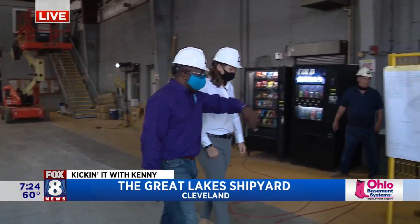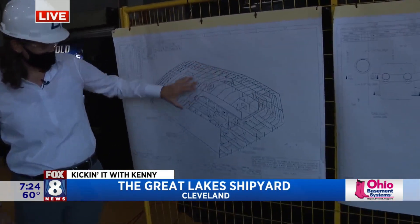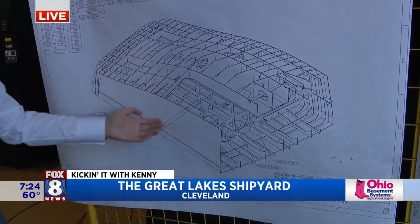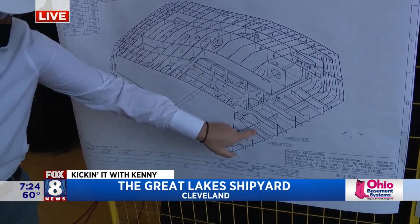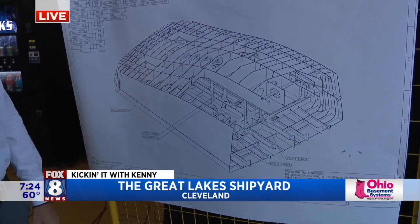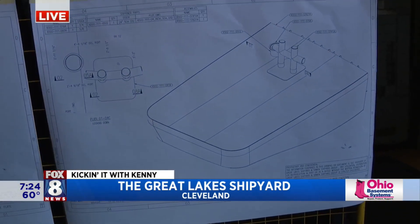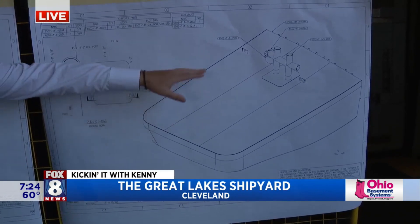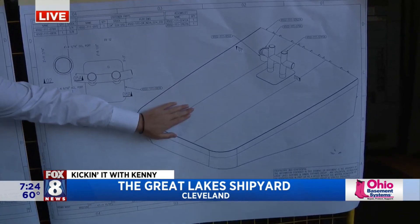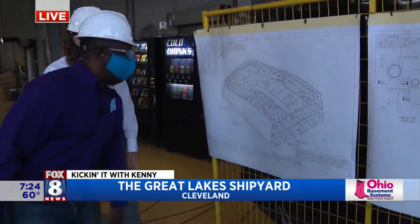Through the magic of TV, we have a great diagram here. So this is the part that's in the water — it would be pretty hard for this to be on the bottom when we're building it. The flat bottom right here, and you can see them putting all these little scantlings in and the main plates — this is all the superstructure that supports the weight of the boat. On the right you can see that when the boat's in operation, the guys would be standing on the back, and that's where the line would be tied on that big H-bit right there. This is what's on the main deck in the fab shop.